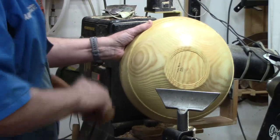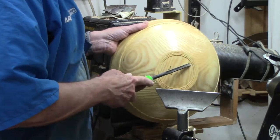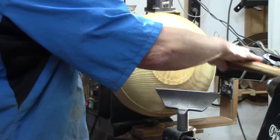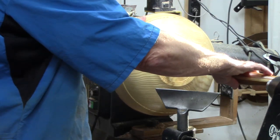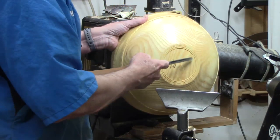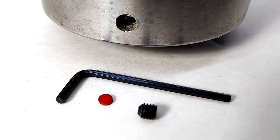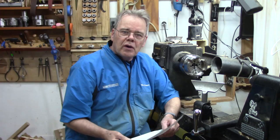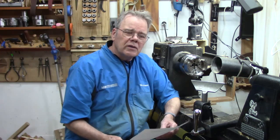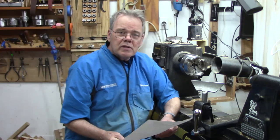I do on occasion turn in reverse when I find it's easier to cut on the backside of a detail, as opposed to leaning way over the lathe and having to swing a tool out — sometimes for a bead it's easier to do it this way. Most chuck manufacturers are going to provide you a set screw that will go in on the back of the chuck, and generally it will land in an area where there aren't threads, though depending on your spindle some instances might land on the threads.